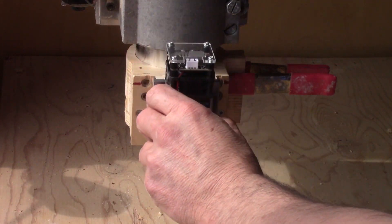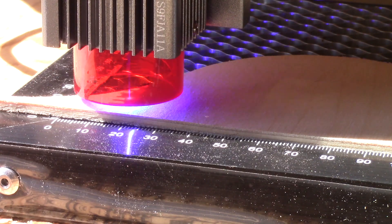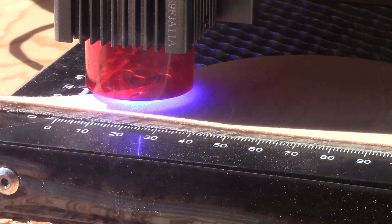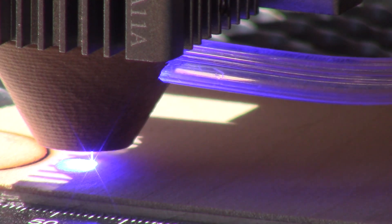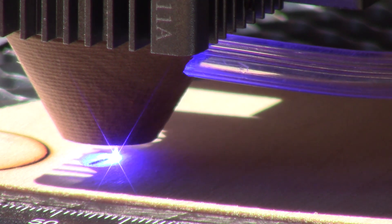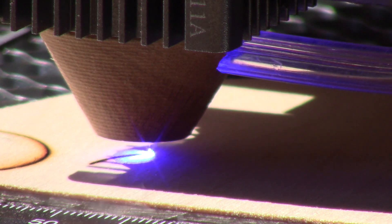This is how the laser will stay in place on the CNC. Have you noticed the cone-shaped tip that I made? In fact, this was a multi-day project in itself. Originally, the laser came with a protective red cover. With this protector, the smoke from the laser burns the top of what's being cut. When I use the one I made, there's no burn mark — that's simply because of the air I'm blowing on the piece while the laser is working.